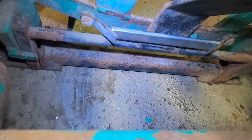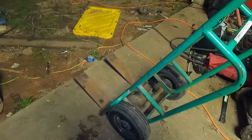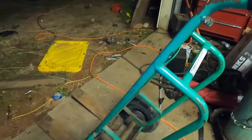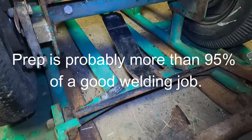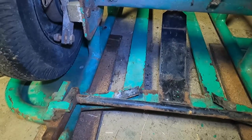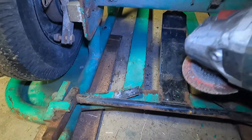My bar — my replacement bar — on those springs is working just right. Now we've got to clean this thing up and get that little bar welded. But no matter how good your welder is, your prep work is 95 percent of your welding. You can't weld over rust, you can't weld over paint. One of the most important things when welding anything is you've got to take it back down to bare metal.